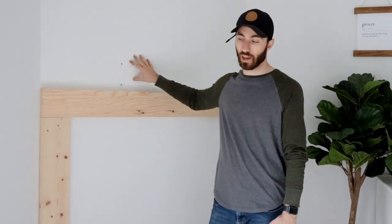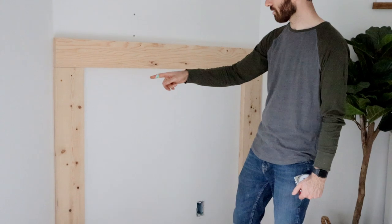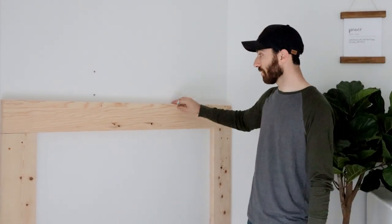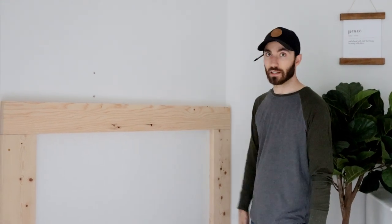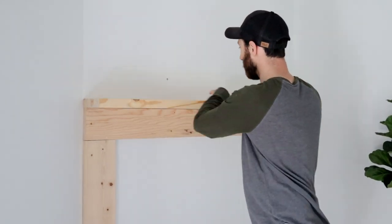You can build this to whatever dimensions you need. We built ours the whole length of this angled wall. Our first boards are 48 inches tall — both panels are 48 inches — and then we took a board across the top that was 52 and a quarter inches, which is the length of our angled wall. We are going to install this to the wall and then go ahead and mount the mantel. The mantel's top piece was also cut to 52 and a quarter inches, and we are going to screw it in along the back.